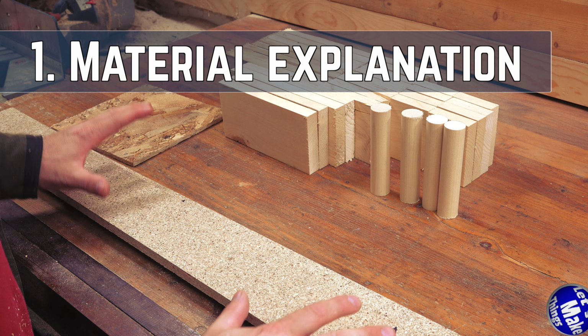It's very simple. Now, to make each one of the boxes, we want to measure in on both sides 1 inch. So I'll take a piece of scrap the same width, and I'll measure in 1 inch on one side and then 1 inch on the opposite side. And this needs to be obviously the same width as all the rest of the boards that we've got. So I'll come in here and mark these. And this is for each of the boxes. So I've got 1 piece here. I'll go on to the next.